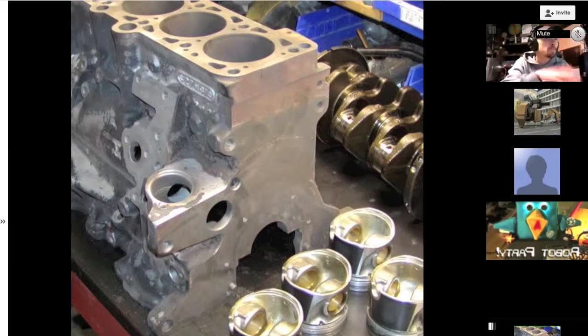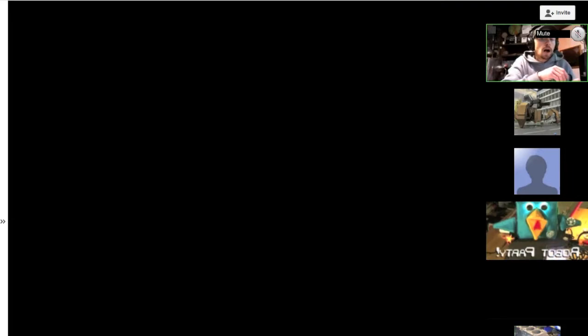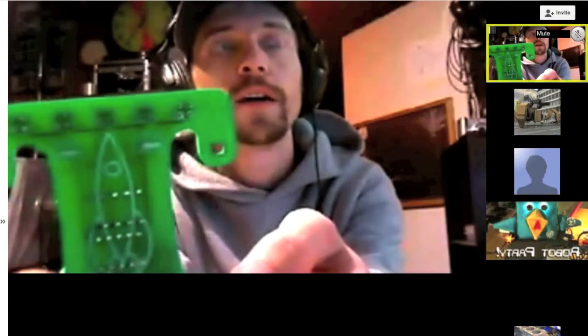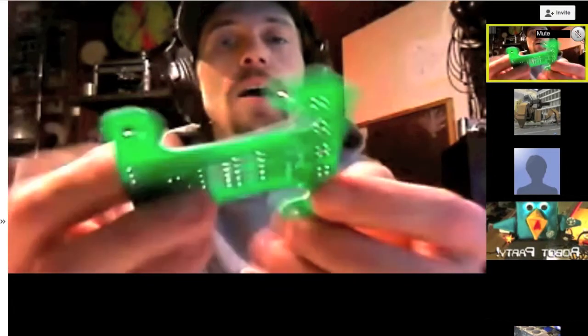The follow-up question is whether there are sensors that work at 400 nanometers. At 400nm you're close to the range of just a basic LDR — just a light sensor. There is a sensor that converts light into frequency, so getting one tuned for your specific wavelength might help. The sensor holes are four-in-a-square with standard 0.1-inch spacing.